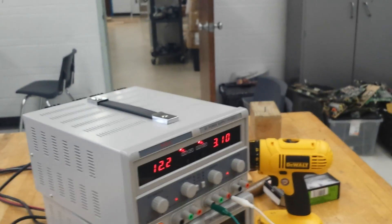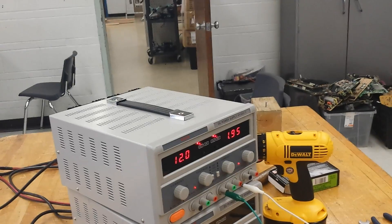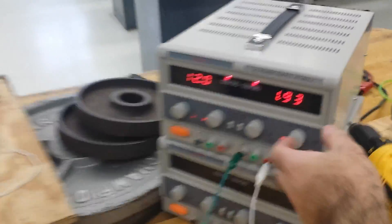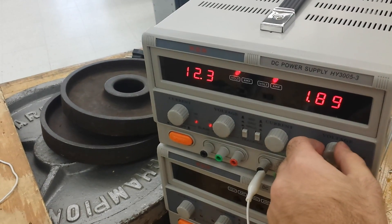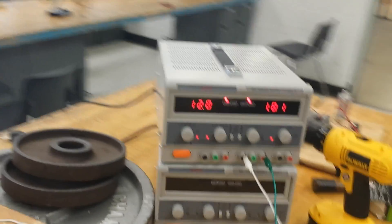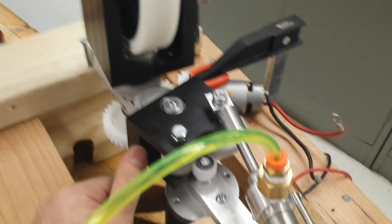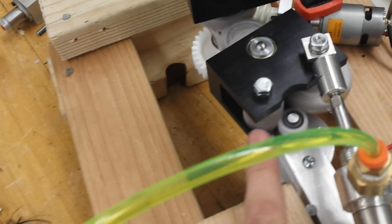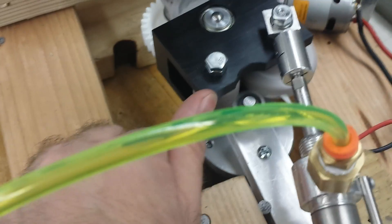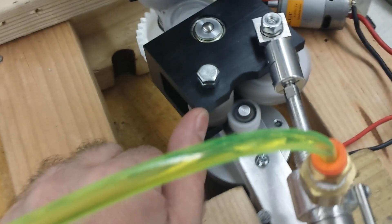This side is about 3 amps. Shift it — right now it's about 1.94 amps. And then if I change directions, it'll be even less. As you can see going in this direction, it's 1.8 amps in low gear. And when I shift it — it looks like it's about 3.5. Earlier it was lower, but we'll dig into that. But the point is, we could optimize a little bit more. And there is no binding here. It may sound like it on this side, but as it's going to be putting counterpressure on it, it doesn't make the noise change or the current any less. So that's just the way it sounds — it's not a binding issue.